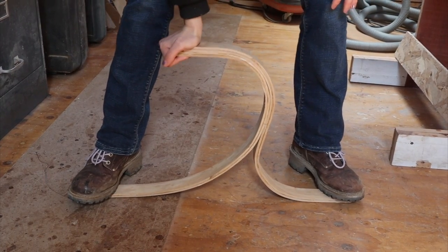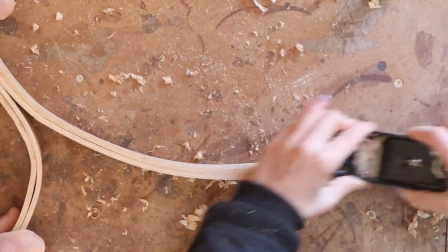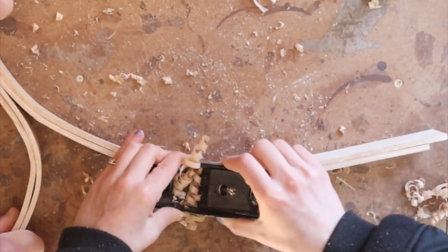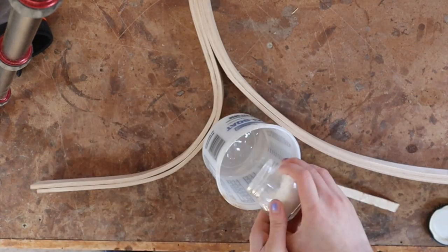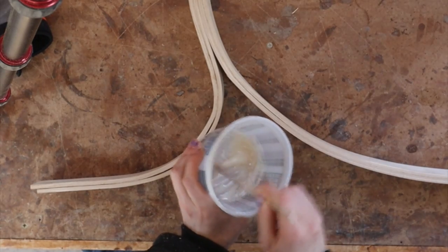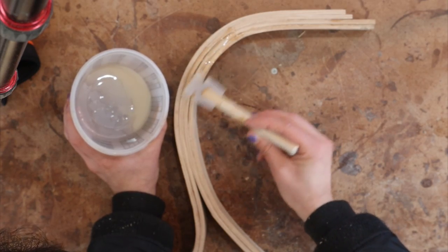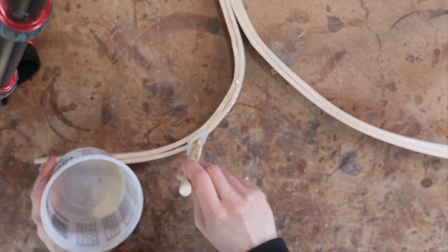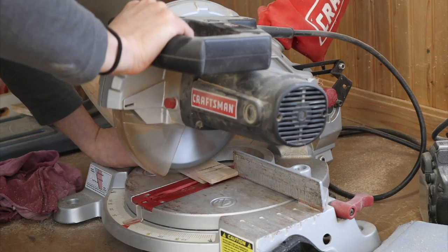That's pretty strong. Then I just cleaned up the edges with a hand plane until it was mostly flat and then used a sander to make it smooth. In all of those little gaps I used a thickened epoxy mixture to fill them in — my secret is that I use kitchen flour, not wood flour, for lighter woods because when mixed with epoxy it just matches the color of the wood so much better. Once it sets I of course plane it and sand it down again.